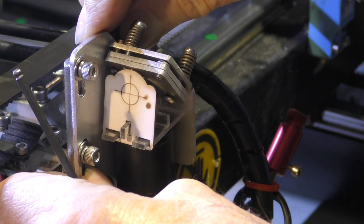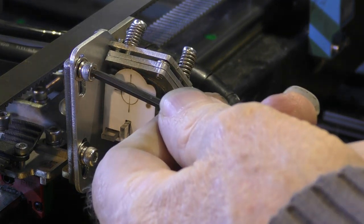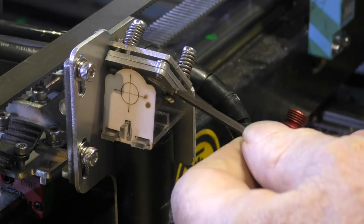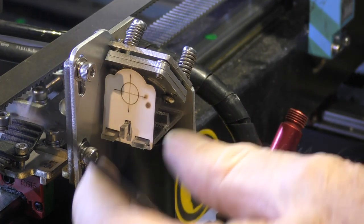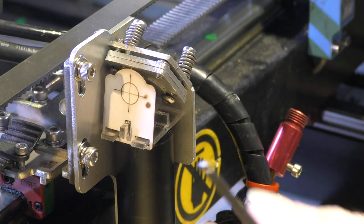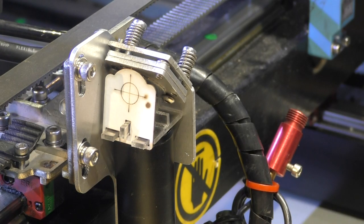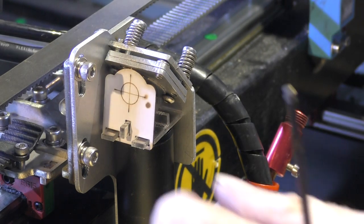We don't need to be very accurate at this stage, if you remember, because this is only nominal setting onto the centre of the mirror, just so that we're roughly aligned with the centre of the mirror. Then we've got to make sure we find the sweet spot on the mirror to get right down the axis of the lens. Now, whether or not I should be able to do that with this mirror, I don't know, because as I said, let me be honest, it's a crap mirror. It's just a piece of aluminium that I polished up, and it's not particularly flat.